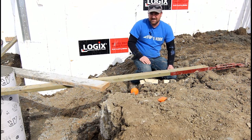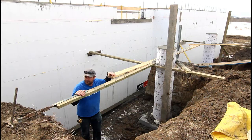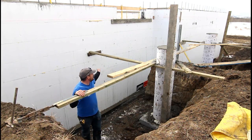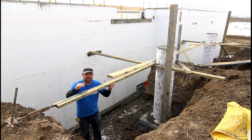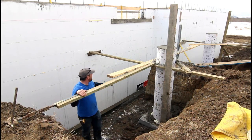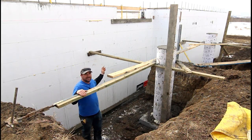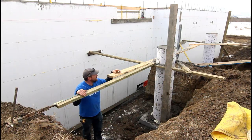So that's it — it's probably the best and simplest way to set a pile. And because these piles, the way that Mike has set them, are such a thing of beauty, I just wanted to show you the two that we did out front. Same method: tied to the wall, one holds it all up, this one is your turnbuckle so you can adjust left and right. Everything's based off dimension that way — as you straighten the ICF wall, it keeps these plumb to the same dimension you need based off the print.